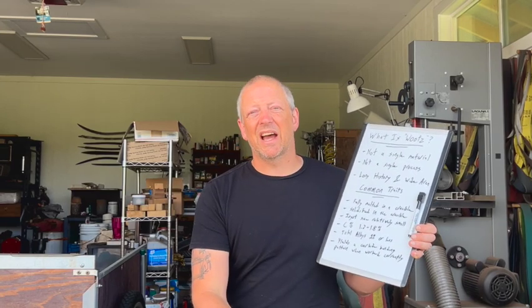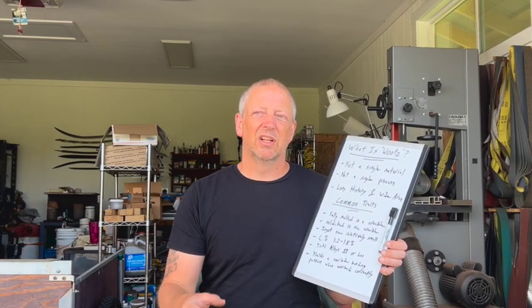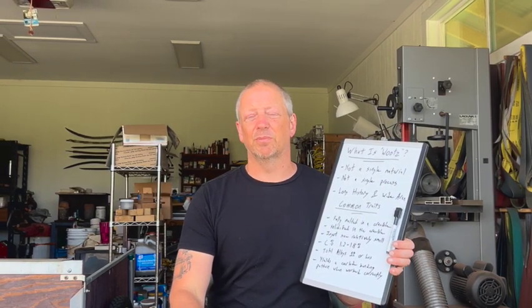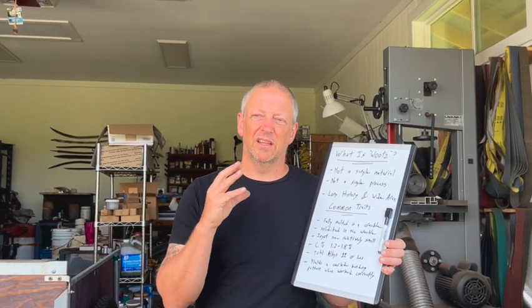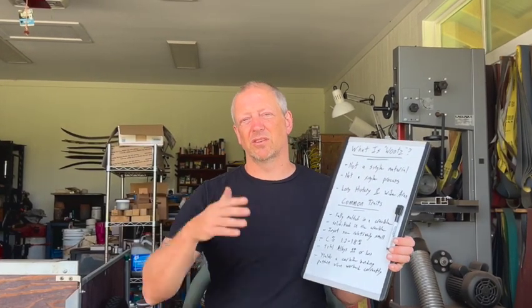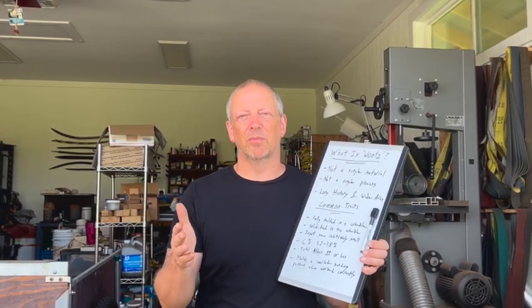Next, ingot size is relatively small. And this becomes pretty key, especially as we get to the transition to modern metallurgy, which really started with the crucible process that was developed in England. And that was developed based on the Wootz process, but it was scaled up enormously. So we went from small crucibles that ingot size was generally between 1 pound and 4 pounds. There are some that were bigger, some that were smaller, but as a general rule, most of them were in that size. So, about half a kilogram to 2 kilograms.